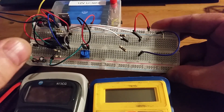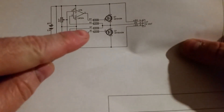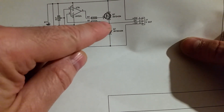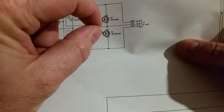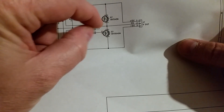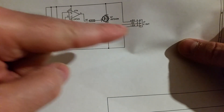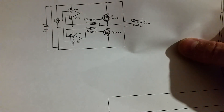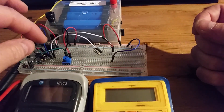Because I'm splitting the power in half, I want to make sure I'm not conflicting the power or shorting anything out. Each MOSFET is going to be supplying 50% to ground, and I don't want them conducting at the same time — because if they conduct simultaneously they would short out at the point where they're connected together. They should only be conducting when you actually want to supply power to either the positive or negative rail.